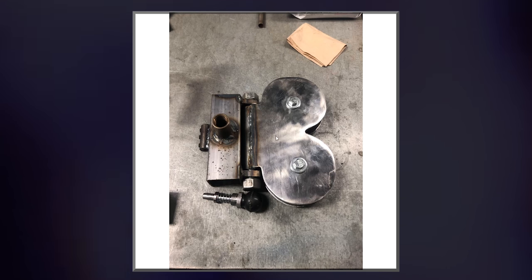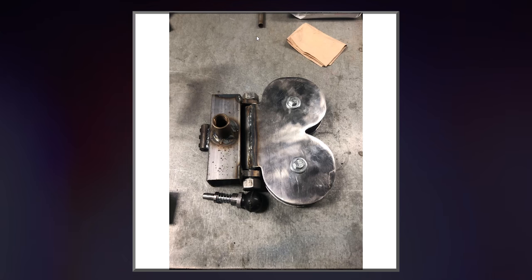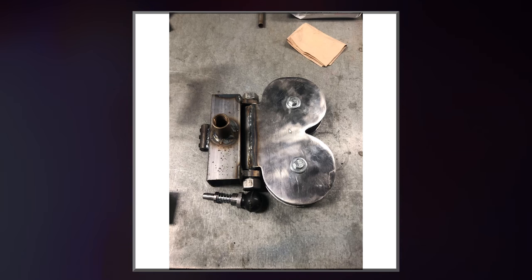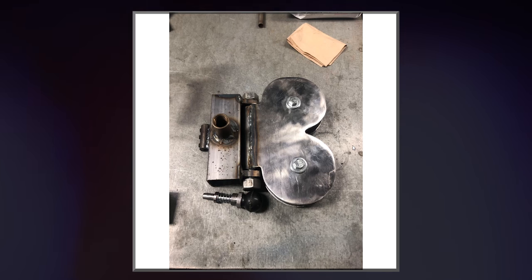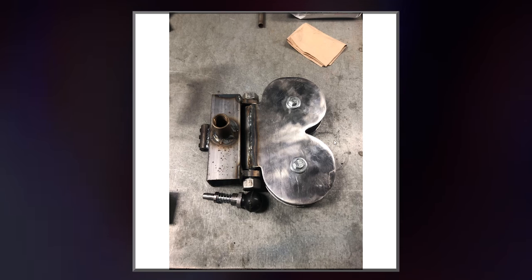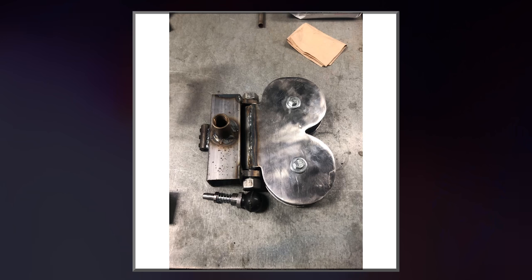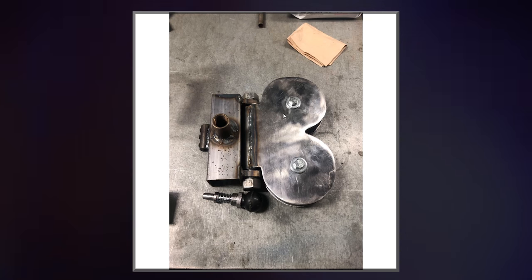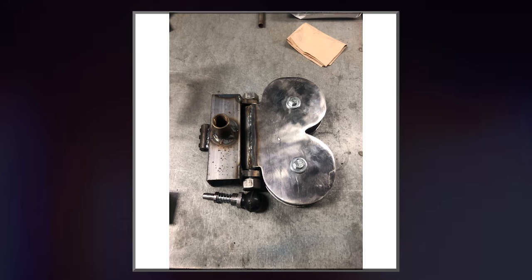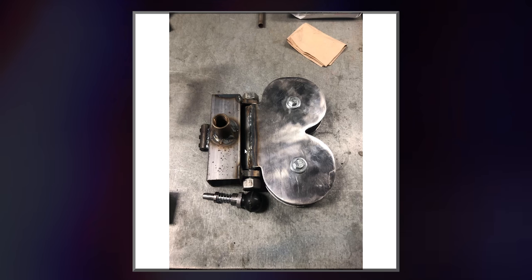Another important thing to think about with this piece, if you look at my mouse cursor, the cable is going to be coming down right here and out right here. And this is where you're going to be able to hook up any attachments. Since it's the attachment hookup place, you want this entire thing to be able to spin and rotate freely. This little boob-shaped bracket holds these two pulleys in order for you to be able to do an upward pulling motion and a downward pulling motion, whether this device is set high or set low on the machine.